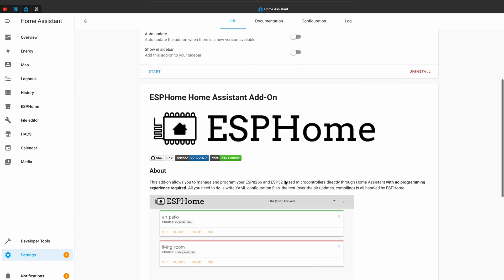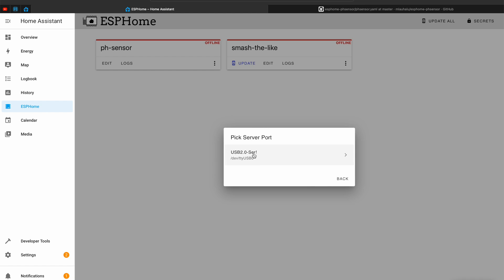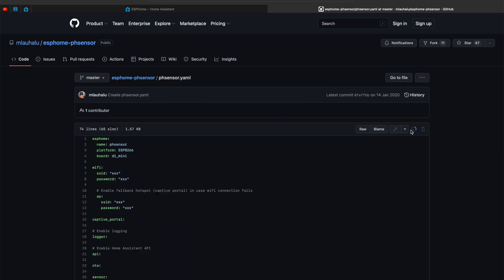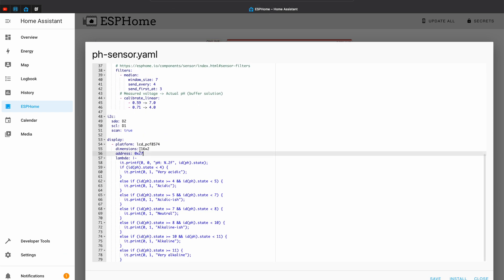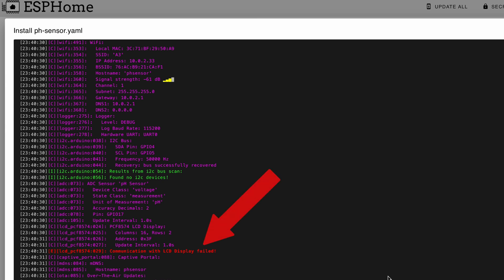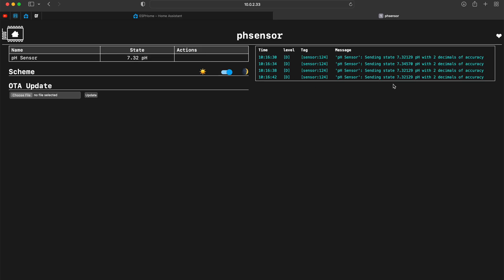There are several ways to install ESPHome and I covered most of them in another video, so go check it out if you wish to know more. I used the ESPHome add-on inside Home Assistant to upload the software. The key moments here: first I had to connect the D1 Mini to the device where Home Assistant and ESPHome are installed in order for the device to be detected, and second I had to copy and paste the code from the GitHub project into my ESPHome device. The only additional thing I did was add the display address because I saw some errors in the logs and the display didn't work without this address. I also added a web server so I can connect directly to the device and see the readings there.